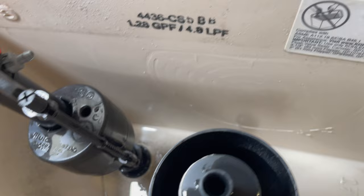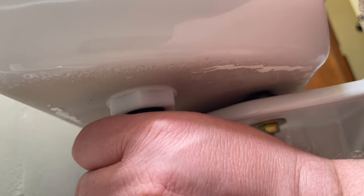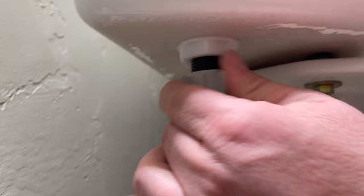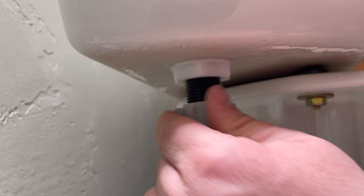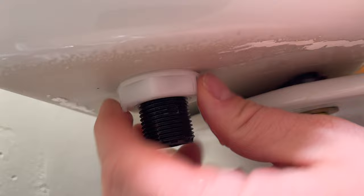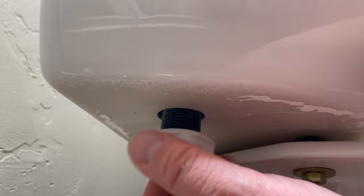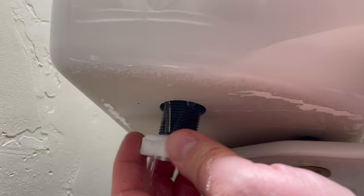Down here I need to detach underneath the bottom of this silent fill valve to remove it. Luckily for me this is all by hand. I want to remind you I've got the water valve off. A little bit of water came out — no big deal. Then there's the little nylon nut here. I'm going to have to get some channel locks on there because it's probably too tight to do by hand. So I loosen that with my channel locks.